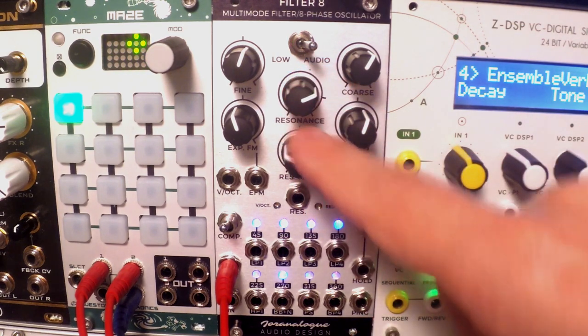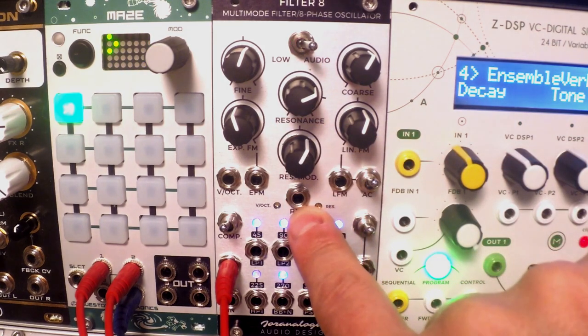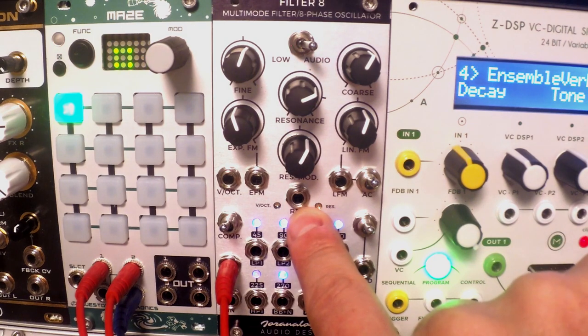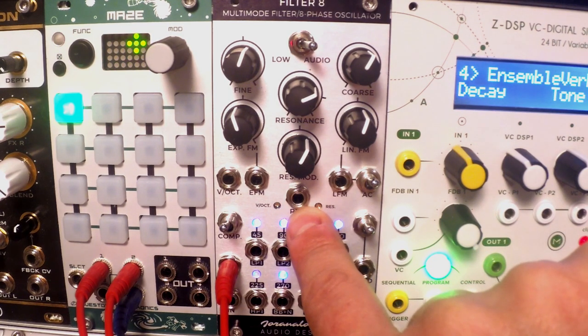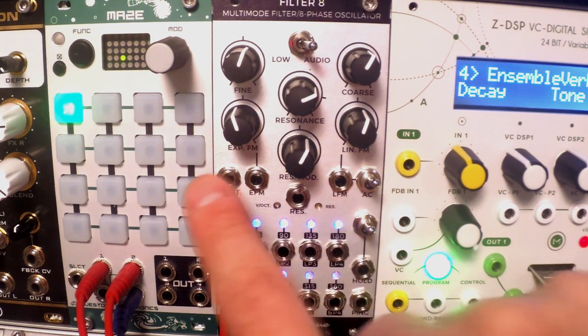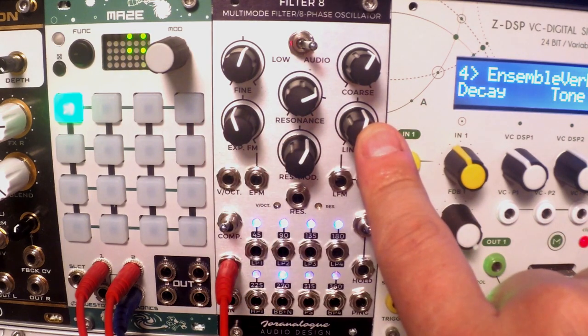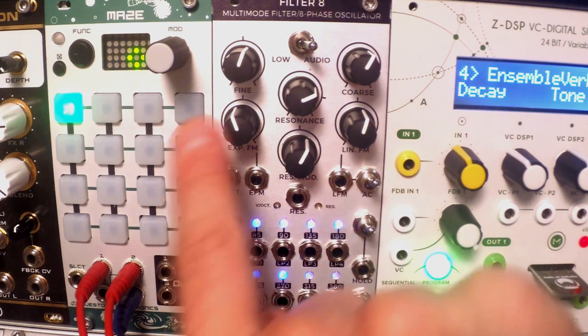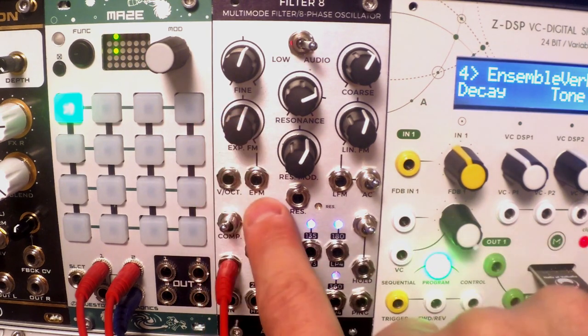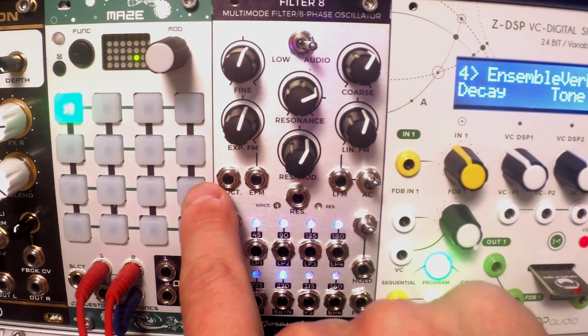This is bipolar, so minus, zero, plus, and you can inject some modulation sources in here, and I'll encourage you to try traditional CVs as well as audio rate signals, actually in all of the inputs here, because it's a ton of fun. Besides that, on the sides we have two independent frequency modulation circuits. So here you have the exponential FM, which also has the volt per octave. This module, while in oscillator mode, can track easily 5 octaves cleanly and above.